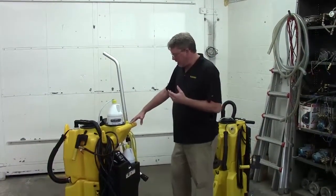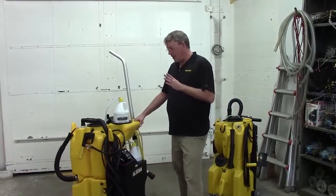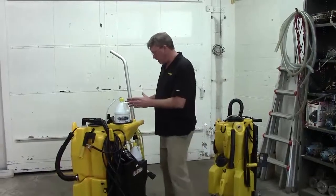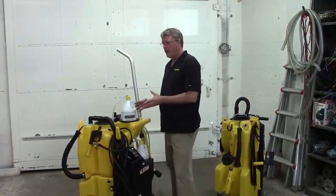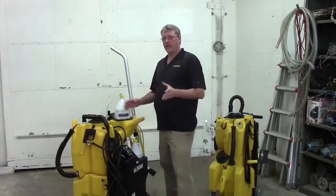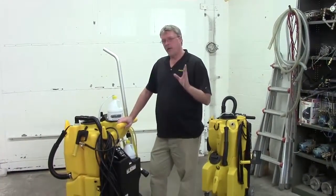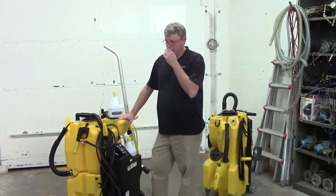If it's none of those things, it more than likely could be something in your pump. So if you start off and you go to clean your filter and it's missing, there's a good chance you've got debris inside your pump. Check out our pump maintenance video. We'll show you how to clean those valves inside your pump.